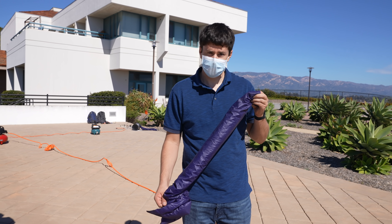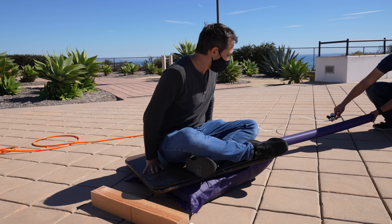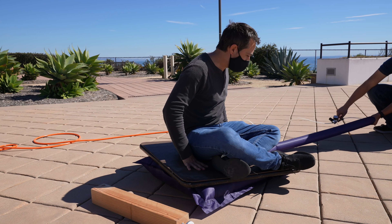What sort of area is that pillow there? It's 600 square inches. So with one PSI, that's 600 pounds. Two PSI, 1200 pounds. And the whole time it feels really soft because there's only a couple PSI. It's important that the device is still soft so it doesn't hurt anyone.